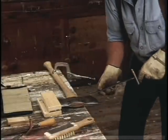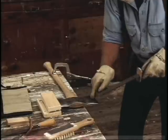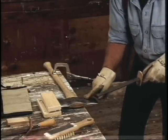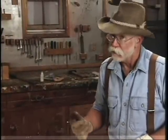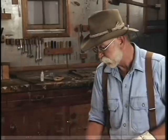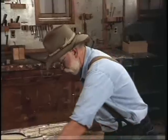The finished shape is going to be a half-moon — like this — filed more back here into the cheek. Now remember, I'm not just sharpening this, I'm rehabbing this axe and then sharpening it. If you take care of your axe, you can touch it up in 15 minutes with a file and the stones. But when you're starting over with one, it takes about an hour to do that.